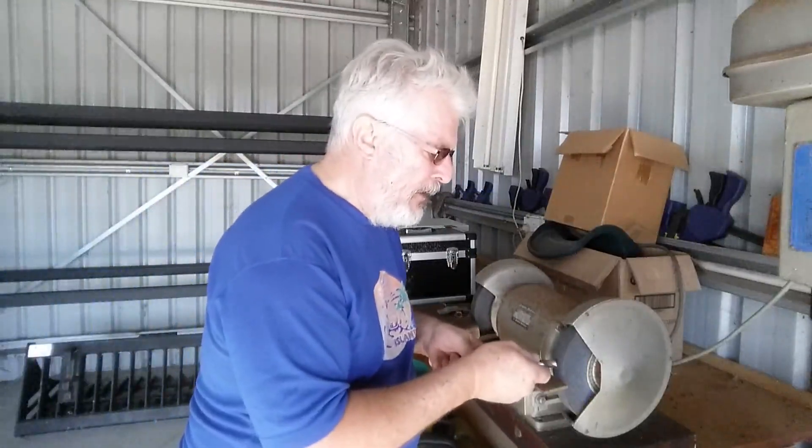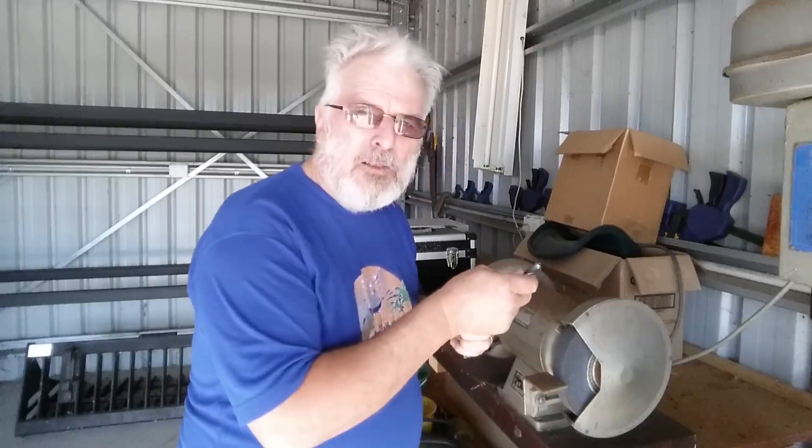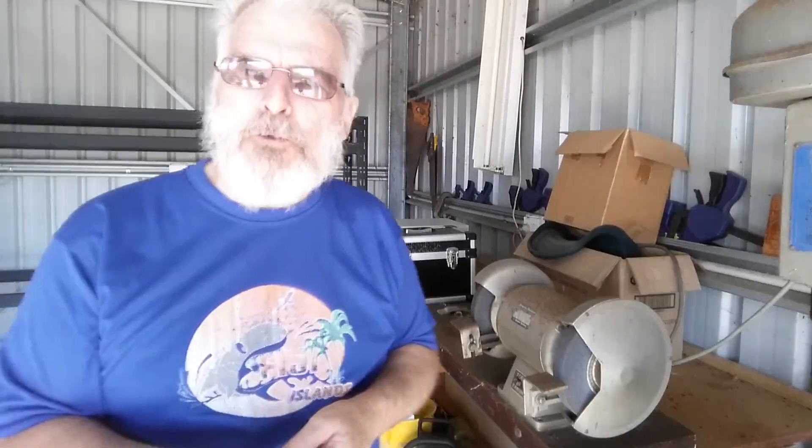To recap the key tricks: 60 degrees, get the cutting edge horizontal above center, and stroke gently up — that's all there is to it. Go and try a large drill first, see how you go, and then work down to the smaller ones. My eyesight's getting a little fuzzy so I have to wait for a really bright day to do my little drill bits, but have a lot of fun — the sharpening is really, really easy.